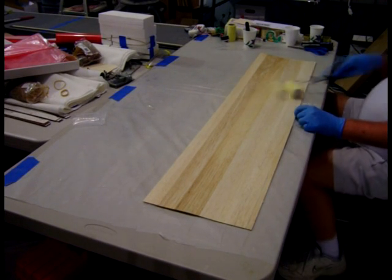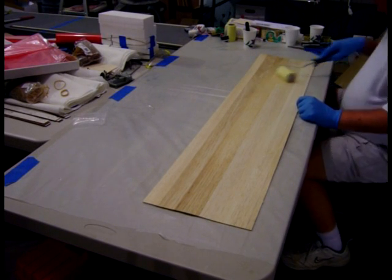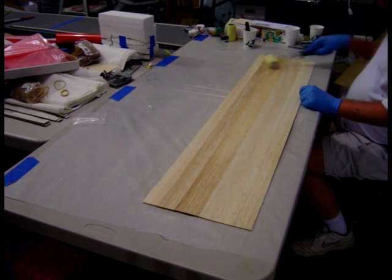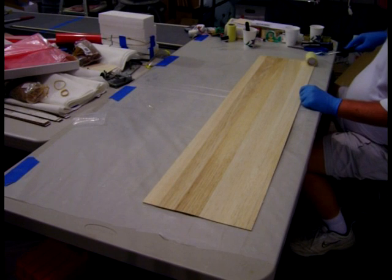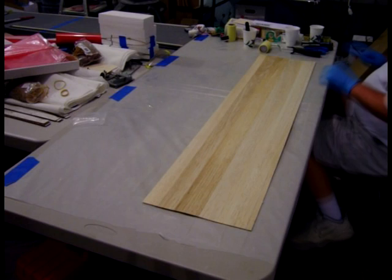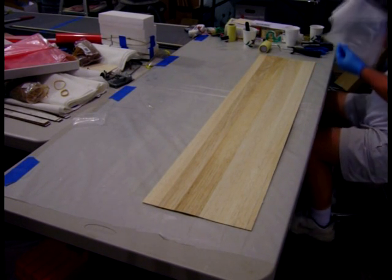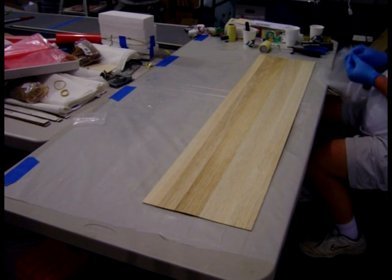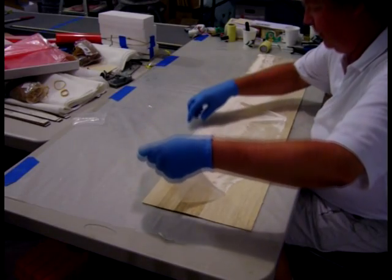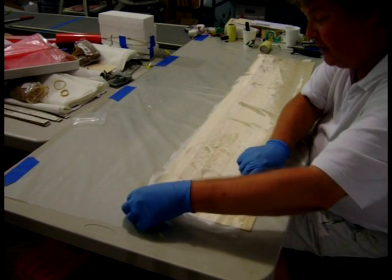You can probably see that the color of the wood has changed slightly. What I'm going to do now is put some .6-ounce fiberglass cloth on the wing skin — I use it entirely between the foam and the balsa. If you use too much epoxy on the wing skin, it actually makes putting the fiberglass down harder.